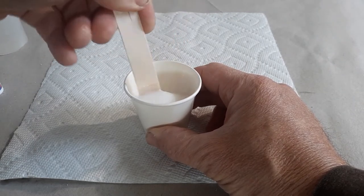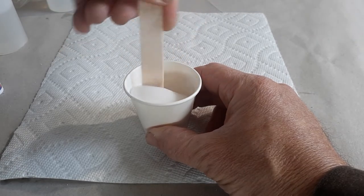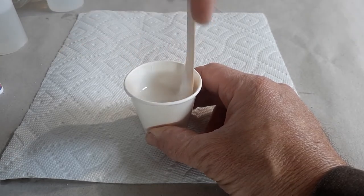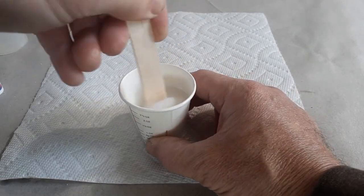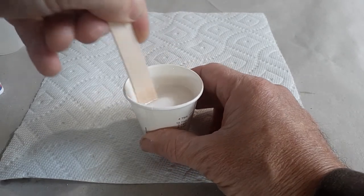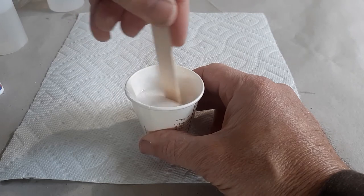The other extreme is super fast curing urethane resins — you probably want to stay away from those, although they will work for smaller parts. You want something that's not super slow and not super fast. If you are going to use a urethane resin, I recommend using talcum powder or baby powder for your mold release, because it creates a nice barrier and gives you a much nicer casting.